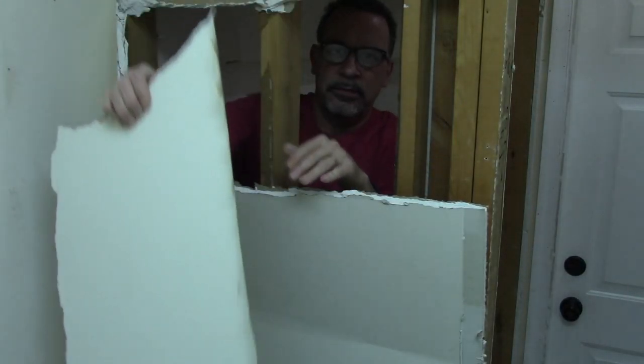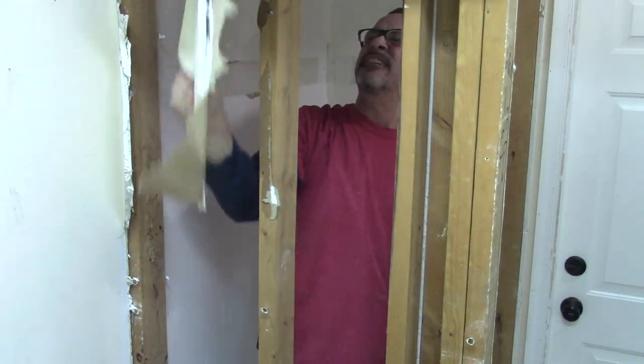So far we're lucky — in this wall there's no electrical or plumbing that we need to reroute. In one of my previous videos I had a tool that allows you to make a small hole and take a look inside the wall so you'll know ahead of time. Once you get your drywall down you're going to want to start taking your studs out. You need to make absolutely certain you know that it's not a load-bearing wall. The last thing you need is to be cutting out studs and have the second floor or the attic come down on top of your head.